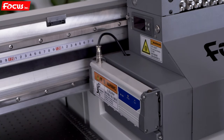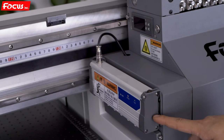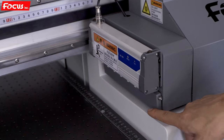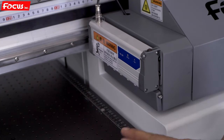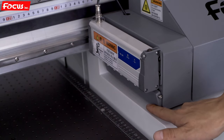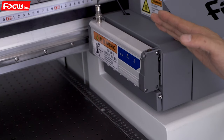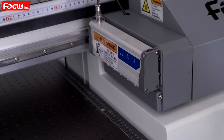We need to make sure the ink jetted on the material will not be repelled or deflected, because if there is too much static electricity on the surface of the material, the ink jet print will be deflected. This is the static eliminator device at the left. At the bottom here is the anti-collision system to protect the print head and carriage. If some material on the table is higher than the surface of the print head, it will hit this anti-collision system first, then the carriage will stop moving. Once you release the anti-collision system, the carriage will recover to print.